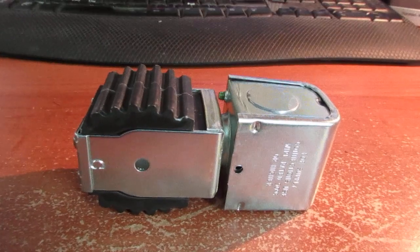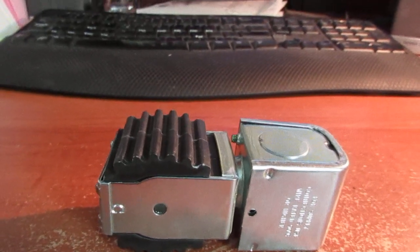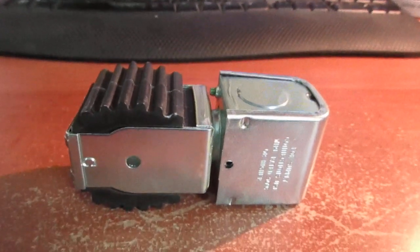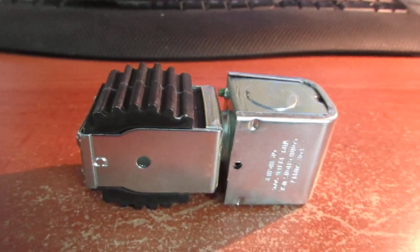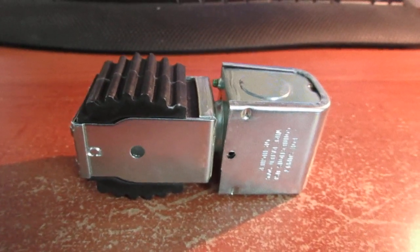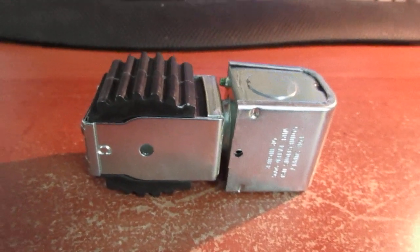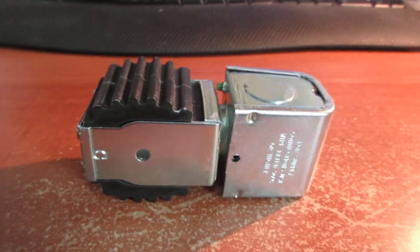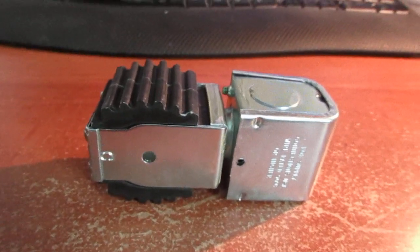The problem sometimes — and I haven't seen it that often — is if you have a leaky coil where it's leaking current across the winding, the magnetic field drops. It's called the magnetic lines of flux. I was in electronics for 12 years, so I know a little bit about it. It creates a surge in current, so if your magnetic field isn't operating properly and it decreases, current goes up and it burns out your LED — a 12-volt LED indicator that shows you're doing a thermal dump, right on this customer's front panel of his truck mount.